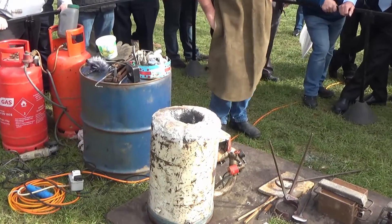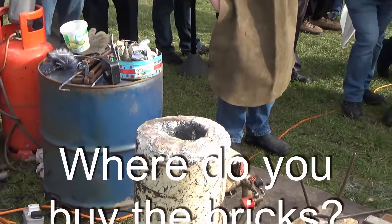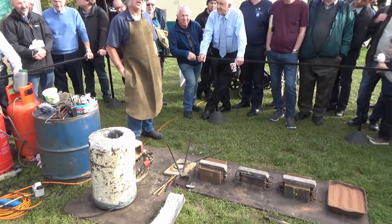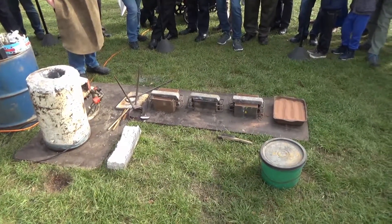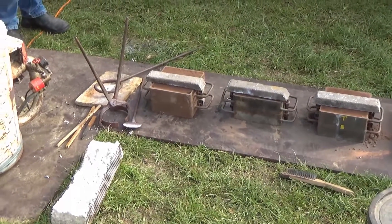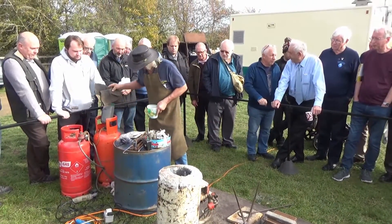The melt itself will take approximately 20 minutes, so for those of you who want to run off and get a cup of tea, you've got a rough idea. Where do you get the bricks from? Normally from suppliers of pottery kiln equipment. If you're lucky and find such a firm being refurbished, they may let you have some of the old bricks — which is what I've used here; they weren't new bricks in the first place. We'll endeavour to light the fire and see what happens.